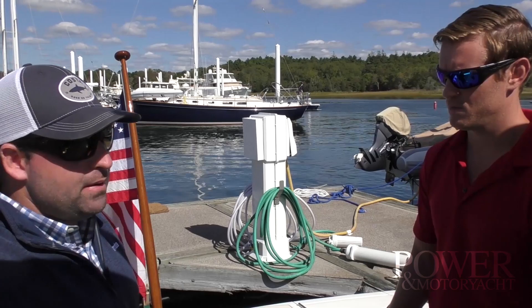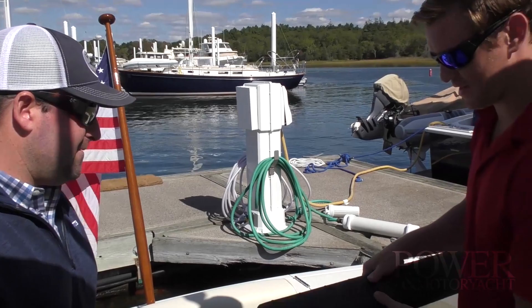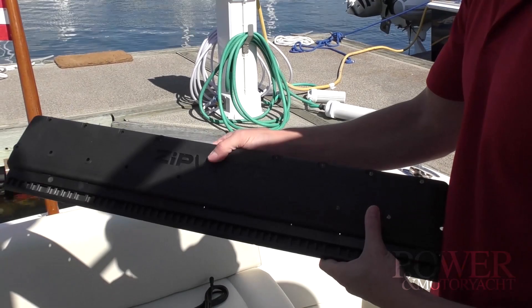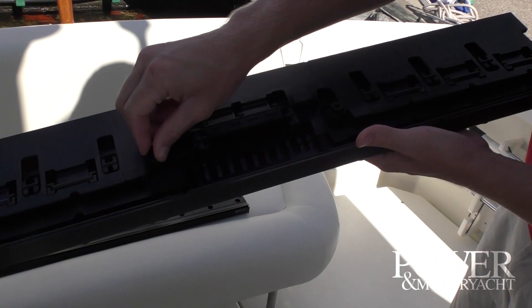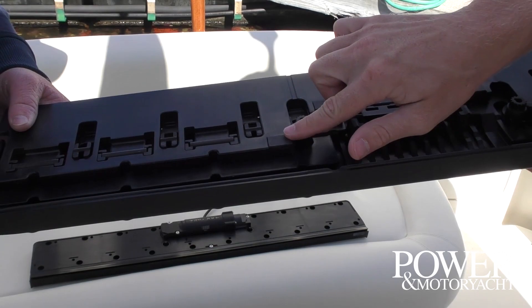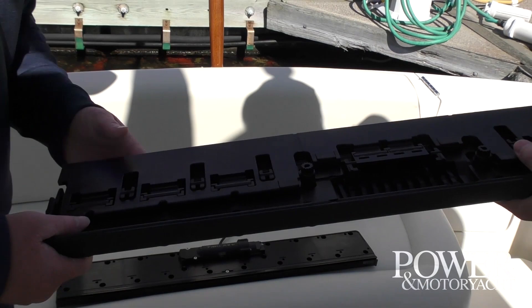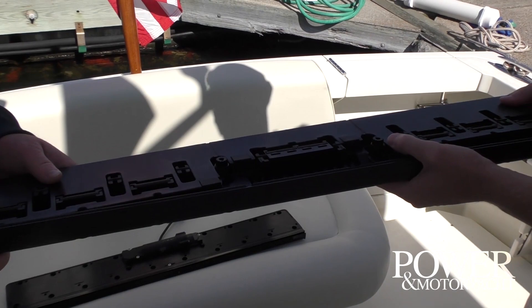What kind of material is this? It feels really strong but it's definitely a plastic. Yes, there's a lot of plastic engineering that's gone into the product. This is a Teflon-based material. If you flip it over, there are a bunch of different types of plastic inside. These are the slip bars — a really slippery plastic that takes the torque off the blade. There's a back plate, and then the blade is a sandwich part in between. When the servo motor runs the blade, there's going to be torque and rubbing on the blade, and those slip bars are in there to minimize the torque and let it slip.